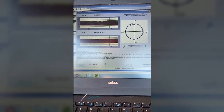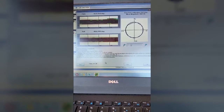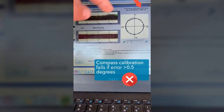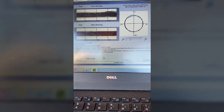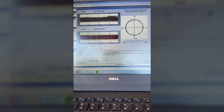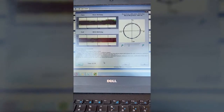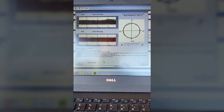So as you can see I did this compass calibration — two full rotations all the way around, up and down pitch and roll, left and right rotating. I did a pretty decent job of covering most of the areas for pitch and roll and covered all the directions for rotation. But what you'll notice is that it says this is not acceptable. You can see a wide variance in the dark blue line compared to the smaller lighter blue line. What we want is for that blue line to be as close as possible to the black circle all the way around. There's more than one possible reason for this: it could be from the magnet tool, it could also be from the six different power lines overhead, or from the bridge nearby — all of those ferrous or magnetic things could cause issues with the compass calibration.